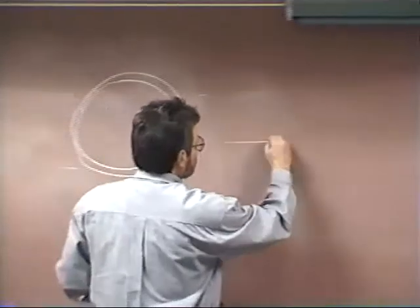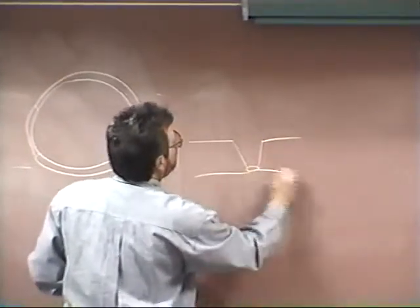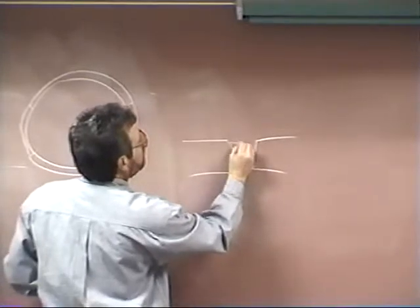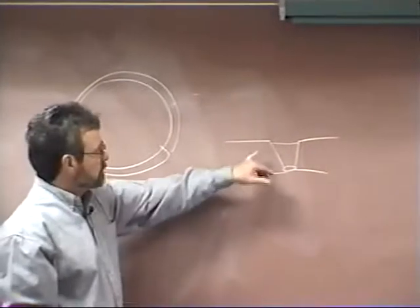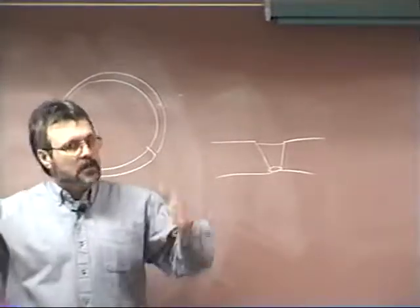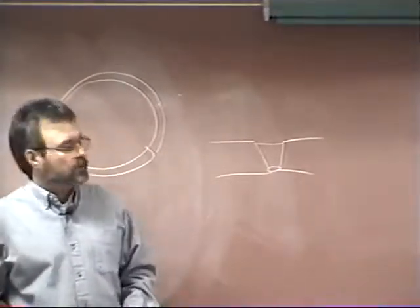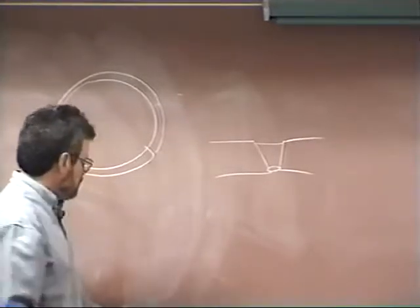And remember now, of course, when you're welding, making that weld, when you've got it filled, you want to fill it to just below flush, just barely below flush. Don't attempt to cap it until you get it just really, really close, because you got to remember, in the downhill position, you're not carrying a lot of metal, so you're not going to deposit a very heavy cap pass with that.